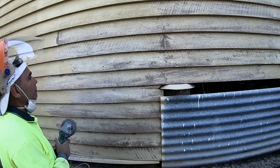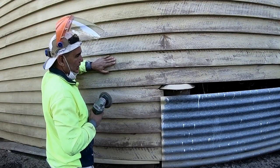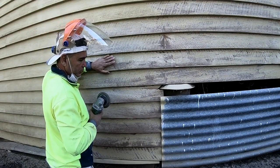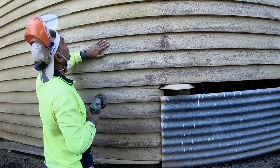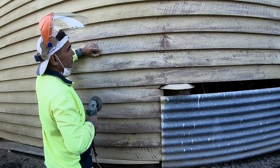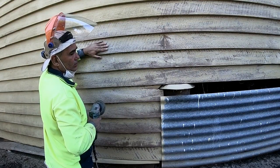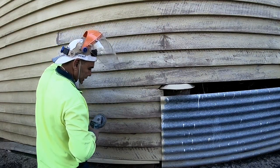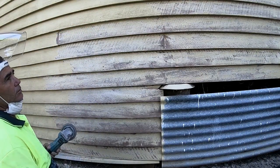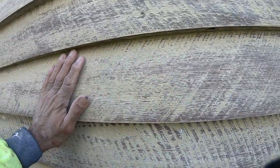So that's how you do it — pretty simple. What we're going to do now is give that a hose down and paint it. Three coats of weather shield. You can go low sheen, gloss, satin, whatever you want. Put the first coat on, putty these holes up, give it a light sand and put your two coats on. It takes that layer off, ready to paint.